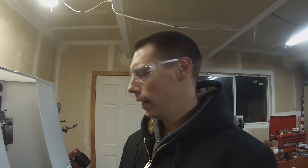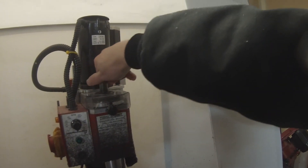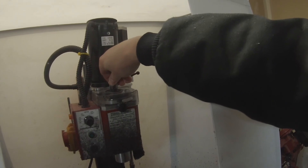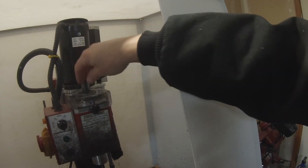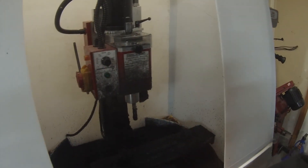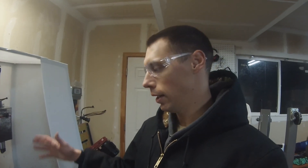That was a lot of machine time — I think this is probably 13 hours of machine time for this little hobby mill. I do notice my spindle doesn't sound very friendly anymore. I've been running it pretty much at full speed, and with the belt drive conversion it's ramped up — I'm supposed to be able to go 4500 RPM versus the standard 2500 — so I might be replacing some bearings. Also the Y axis started to sound a little rough, so I might need to grease it. I've got to get this thing back in tip-top shape again. Thanks for watching — run of 24 parts, that's pretty cool, I'm proud of myself. Have a good one!